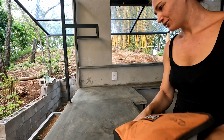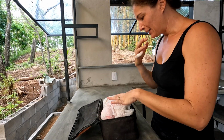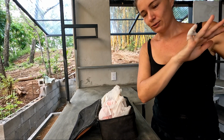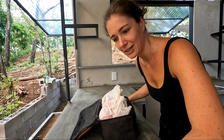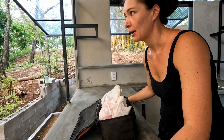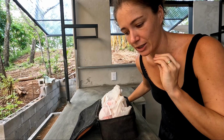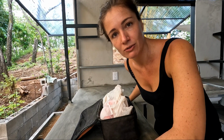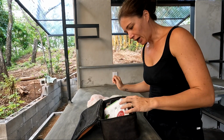So the first thing I need to do today to finalize these kitchen counters is to do the sanding. So I'm going to use a really high grit sand, go through the whole space just to make sure everything is nice and smooth and clean, then wipe it down, and then put some aqua hydrolock on to avoid any moisture going into the sealant, and then putting the seal. So there's quite a few different layers that still need to be done today. So if you're ever doing micro cement, hire people to do it.